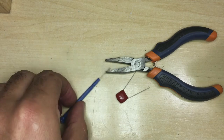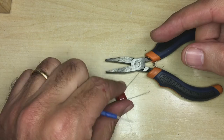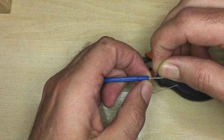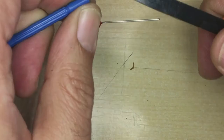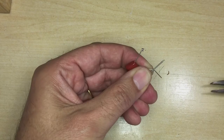This is really all you need — a small screwdriver. You can use a small drill bit as well, probably 1.1 millimeter or 1.2 millimeter. Take the component, and I want to create the pigtail connection about halfway down there. Get these pliers, wind it around, then push it down. I'll do the same to the other leg.